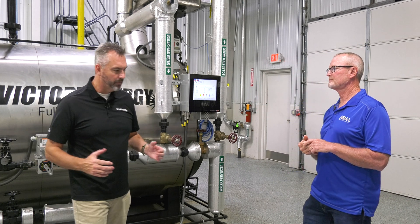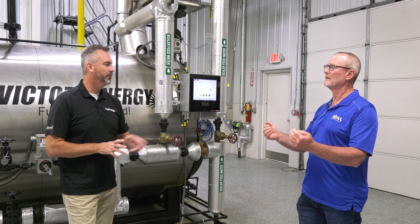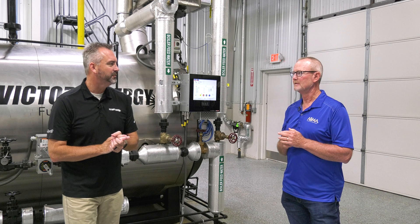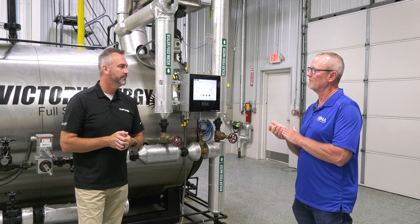For a new operator in a boiler room, listen for that huffing sound. Most of the time it's harmonics — you just hear it — but every now and then it'll do it again. We train maintenance guys to listen for things that are different. Walk through the boiler room, something sounds different — listen to it, see what it is, and start looking to see what you can do to fix it. If it gets into a situation like that, certainly call a service company — whether it's us or someone else — to make sure the combustion is correct. Get that thing adjusted and get things right so you don't have a combustion issue you don't want to deal with. Back pressure today on The Boiling Point — we'll see you next time.